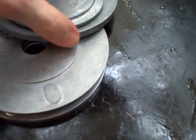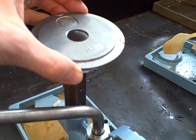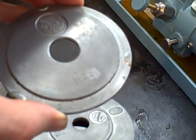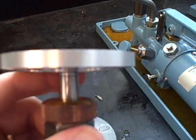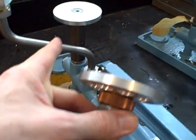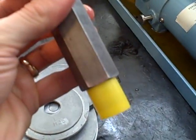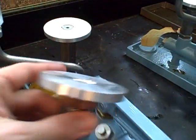It screws in the same hole and we stack the same weights on top. If we take a look at the weights themselves, we notice it says L5 H25. So this weight is worth 25 PSI when placed onto the high-range piston. That same weight is only worth 5 PSI when placed on the low-range piston. The only difference is the size of the piston — on the inside, this is a much larger piston. It has 5 times the surface area, which means a given weight will give you 5 times less pressure than it will on the smaller piston.